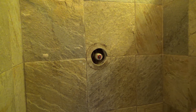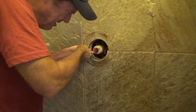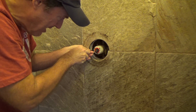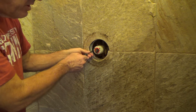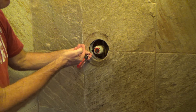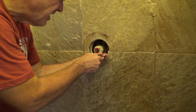Now all I'm going to do is undo those screws, remember? I've got a small shower here, I'm trying to re-situate stuff. Okay, remember on the hot side, I got the handle down — the hot side was two and a half turns. There's half, there's one and a half, two and a half. I'm not quite sure — I might have to ask at the wholesale house next time I order these: hey, what's the deal with these screws? It should be to where if you unscrew it any further, there should be a definite stop point on it, so that you can't undo the screw. If you undo the screw, the screw's going to come out and blow, and all your water's going to blow, and then you're going to have to run outside and find the water valve.